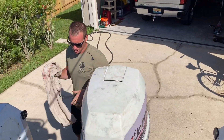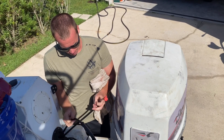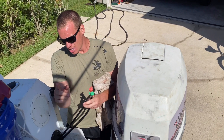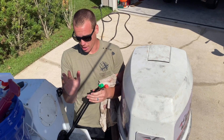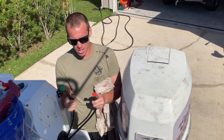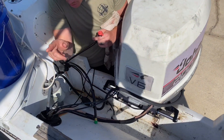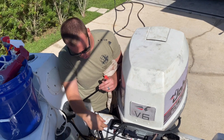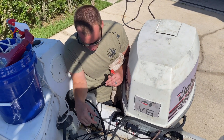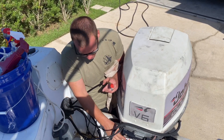The way the diagram explains it: you have two caps, a red and a green, and those are the identifiers. The one you hook up to the port side — obviously port is left, starboard is right looking at the front of the boat — you're going to hook the port side up to the starboard attachment. So it goes left to right and right to left. The right side under the center console will go to the left side, and the left side under the center console will go to the right side. Simple as that.